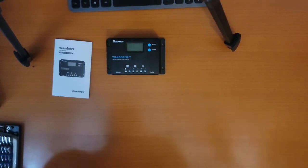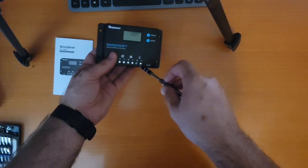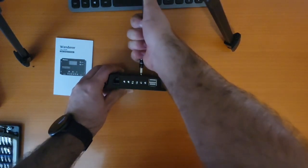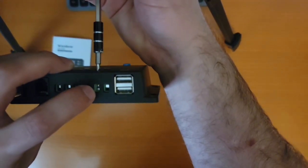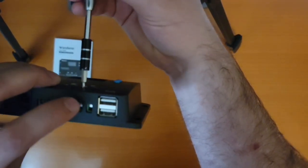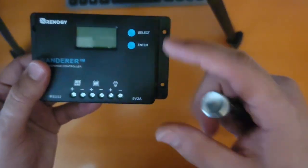What I found out when starting it is that the connectors are all open to begin with. If I turn this to the left and unscrew it, it moves down and opens up the channel to stick the wire in, then close the terminal by twisting it to the right — it pinches the wire up to the top. We also have two 5 volt 2 amp USB connectors, which I verified work. To program this, you start by plugging a battery in.